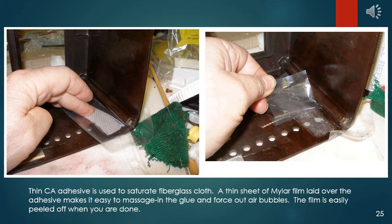Conservation of the cabinet. The cabinet is cracked on the top and right side. My technique is to reinforce the backside of the crack with two layers of woven fiberglass cloth. After making sure that the two sides of the crack are absolutely coplanar, I lightly sand the inside and clean with acetone or alcohol. I lay one sheet of the fiberglass mat on the back of the crack. Using a pipette, I drop super thin CA adhesive onto the fiberglass until the cloth is saturated.